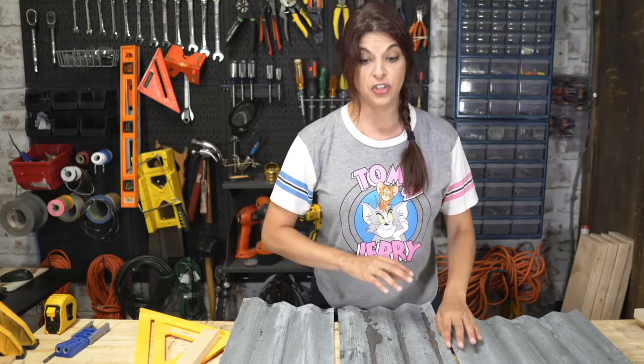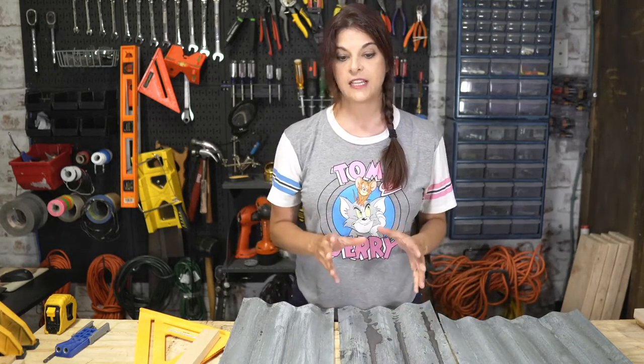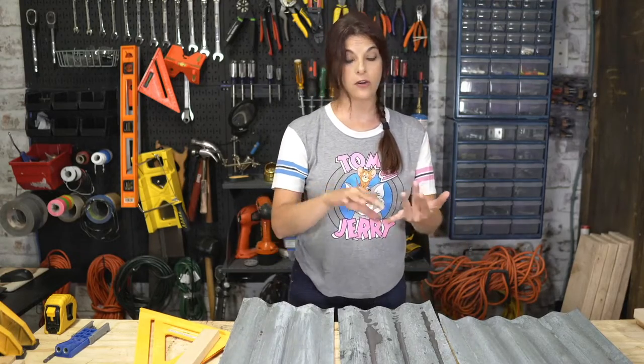In essence, you can just start seeing all of the etching happening, but don't stand too close. Wear gloves, throw the gloves out, because eventually it will eat through your gloves. It's pretty nasty. If you catch a whiff, you'll know exactly what I'm talking about, because if it etches concrete, it's going to etch up all in your lungs as well. So try not to breathe this stuff, work in a well-ventilated area.